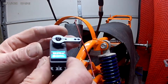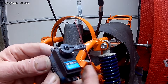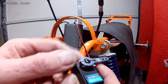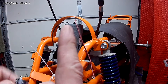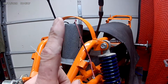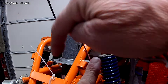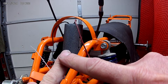I'm also thinking about whether going the other way would push the rear brakes on, or maybe that needs to be a separate servo with a different channel. On the remote control radio, if you go up and down it would be the front brakes; if you go side to side it would do the rear brakes — maybe I'd have another servo pushing on the master cylinder for the rear brake. So if you go up it's front brakes on, if you go left it's rear brakes on, and if you go to the far corner it's both brakes on. So this quadrant up here will be the brakes — more forward brake, more rear brake, and then both brakes.